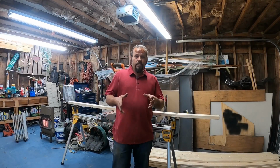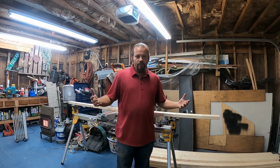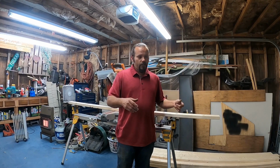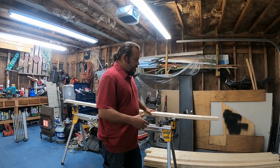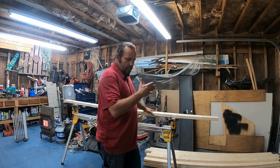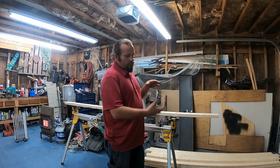Alright, let's get started. Okay, so what I'm going to do first is build the shelves themselves. And it's basically just going to be a box. It's going to be a 2 by 8 foot box. 2 foot by 8 foot. And how we do that is, I have 8 foot 2 by 4s. I'm going to measure out the 2 by 4s 8 foot. And then I'm going to put a 2 by 4 between them.